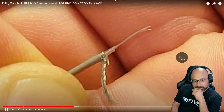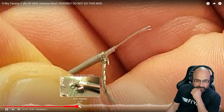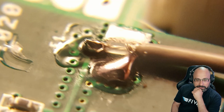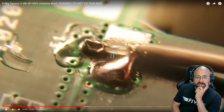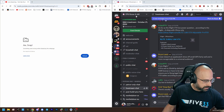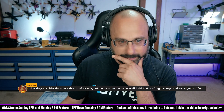The exposed length of center conductor is going to be a radiating element and will affect the antenna characteristics. So here's a close-up of the finished joint — we've got the center wire here and the braid there. We've got to not melt everything and not cut these wires. It's hard, and most people aren't going to do it successfully.